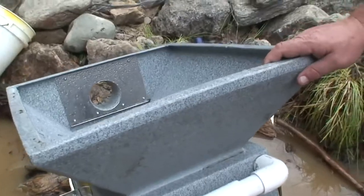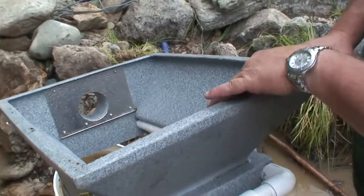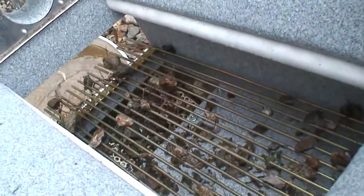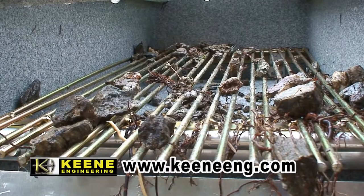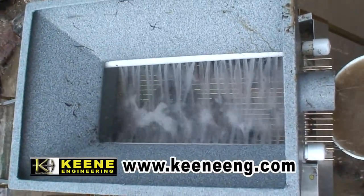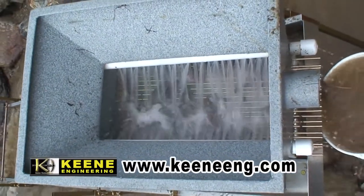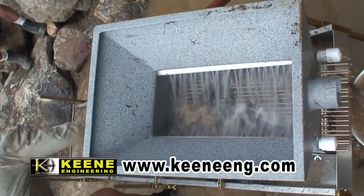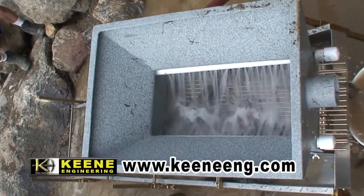The hopper is adjustable on the height, and it's also a little longer, with what are called grizzly screens inside here, than most normal high bankers. That's so if you're dealing with material that's got a lot of clay on it, the clay will stay on there and get rinsed. I can also flatten out the classifier if I want to, so I can keep the clay in there for a longer time, so it has a chance for the water jets to spray and emulsify it.